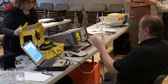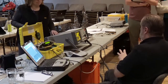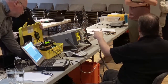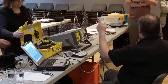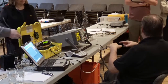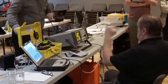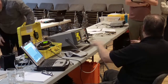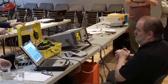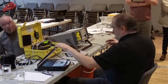It's tough. One thing you have to worry about on some radios, just so you know, is microphones that are plugged in, when you key, sometimes they're hot. So your packet keys up and you've got stuff going, your music in your room comes out over the radio when it's transmitting, along with the data tones, because a lot of them go in the microphone jacks, or they have a jack on the back and it doesn't actually shut off. So if it's hot, it's picking up the sound.